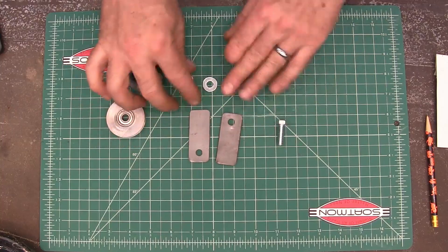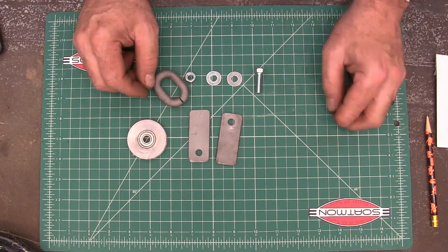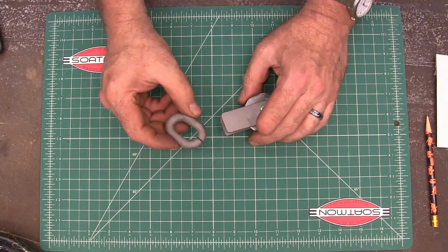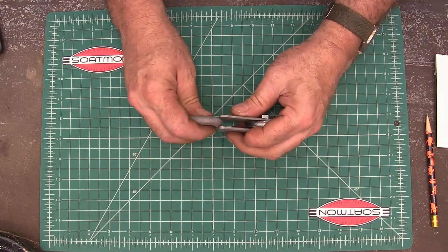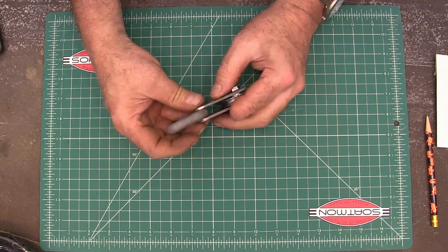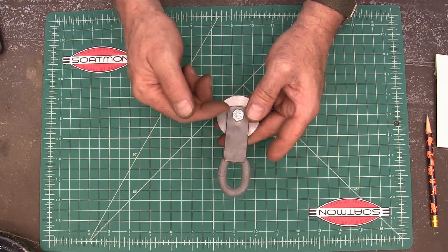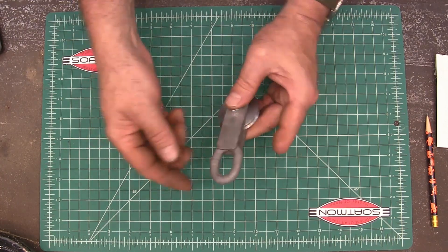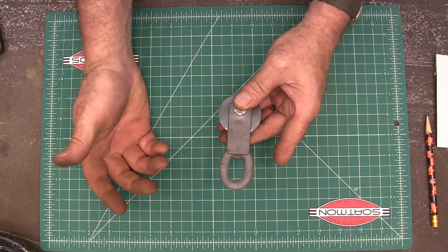Here's all the parts — I sandblasted the chain links and the little straps. I chose this chain not because I needed something this heavy, since something quite a bit lighter would have worked just fine, but it fills the gap I need to fill. I used these chain links because otherwise I would have had to bend the strap and keep it perfectly straight, or come back and drilled it later, or welded a flat piece in and attached a hook somehow. This was a lot quicker and easier, and I actually kind of like the looks of it. So now I'm going to get these welded.